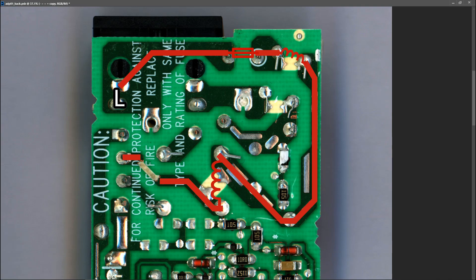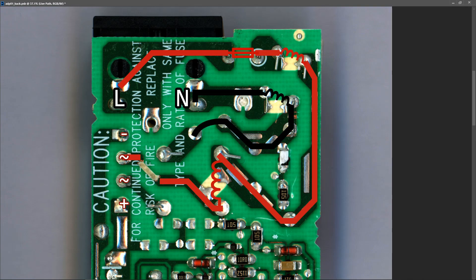I'm going to mark in the pins of the bridge rectifier anyway, as it might help you visualize what's going on. Our neutral wire connects here where I've marked it with a big N, and it follows this path across to a first inductor. Then it comes around onto a jumper on the front side of the board, and then follows the path to a second inductor. After that inductor, it goes onto the other center pin of the bridge rectifier.